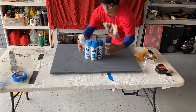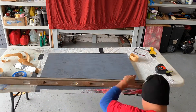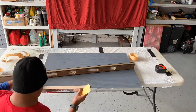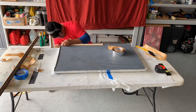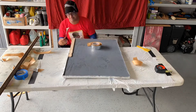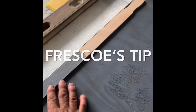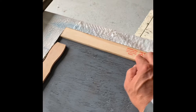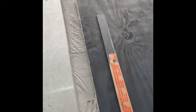The dam goes around the piece of wood to hold and contain the resin and give it a nice ridge finish. We're getting ready to do a resin drop and contain it in the dam. Tip: use painter sticks to measure the height of the dam and keep it level from one end to the other. I also rub both sticks against the tape to keep it flush all the way around the frame.